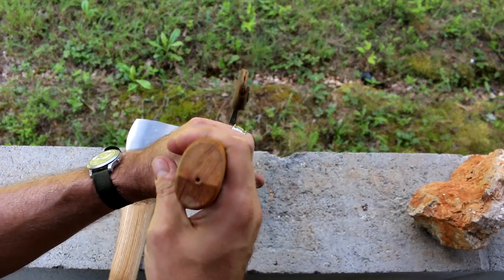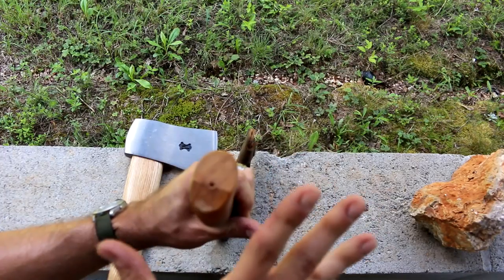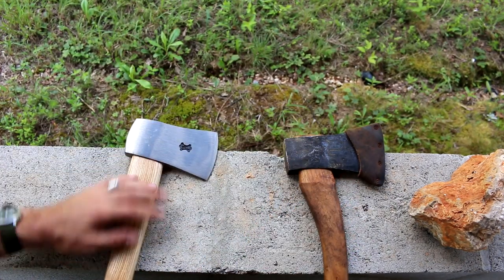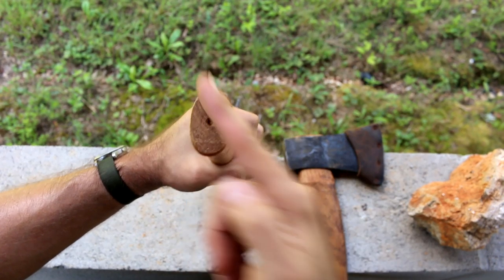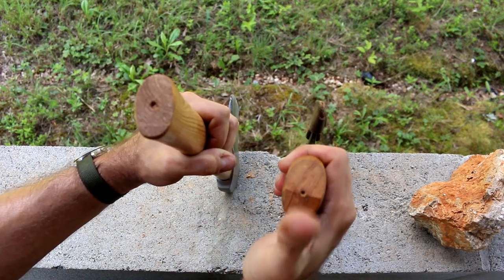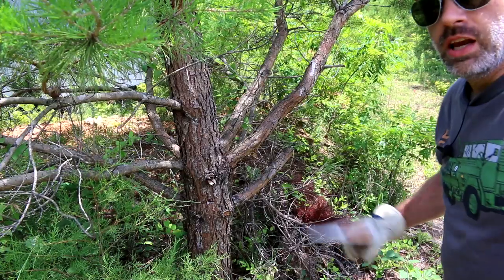When you choose your wood grain for your handle, you can see the grain here is completely parallel to the blade itself — that's perfect. A 45-degree angle would be just fine as well; it's not as big a deal as some people make it, but it is something to keep in mind when choosing a handle for an axe project. If you look at that grain, it is almost horizontal, perpendicular to the blade — it comes in and goes up. This was cut out of a very small tree, so the grain curves, whereas the other was cut from a much larger tree giving much straighter grain. You can see the growth rings going through at an angle and curving up. That's going to be a weak point in this handle.